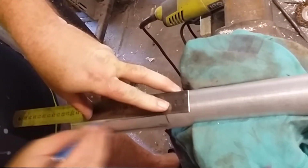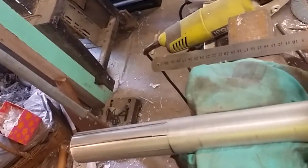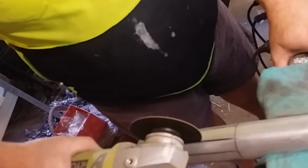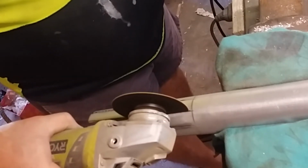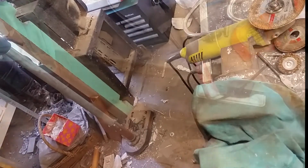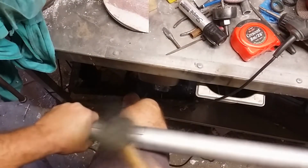I'm cutting in 8 slices with a very small angle removed from each slice so that it produces the taper I need to get the effect that I'm looking for. The piece of tube that you can see there is the same size piece of tube that's going to run through the centre of it. And by holding the little piece of tube in place, I can use the rubber mallet to put a slight bend in those cut pieces now so that it all starts to line up.